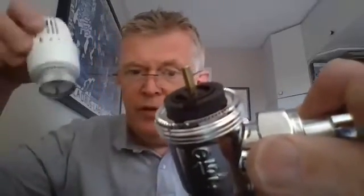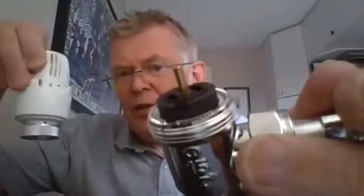And of course, like we've described in my training, with this balancing key you can also swap out the upper gland seal if you get any leakage here. And one last point is because it doesn't have a hex to prevent rotation, it has 72 teeth around this surface. You may not be able to see it because the resolution is not good enough, but those teeth allow you to put on the head in 72 different positions.